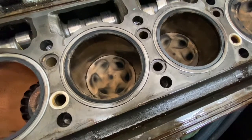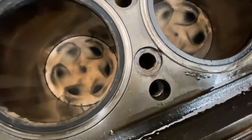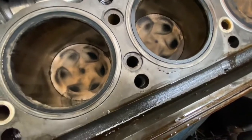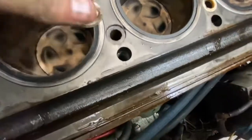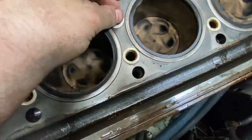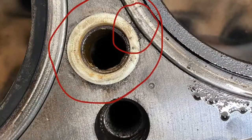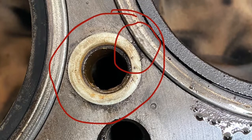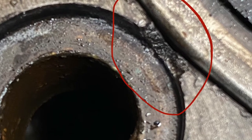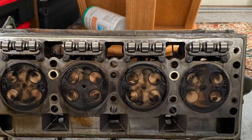And it's on the block. So there's basically a crack or a chip between the O-ring and the cylinder in the block, and that O-ring must have failed because of the heat there or something. Water is now getting into that cylinder, because that is the cylinder with the water. Here's a close-up picture of it. I don't know how it deteriorated, but the head itself looks good. Let me know what your thoughts are. Thank you.